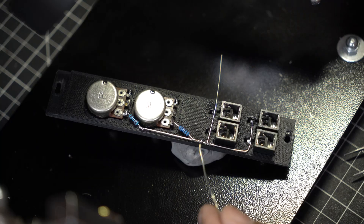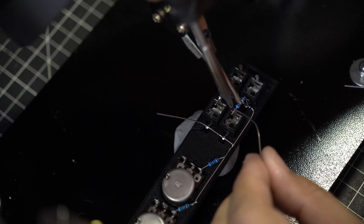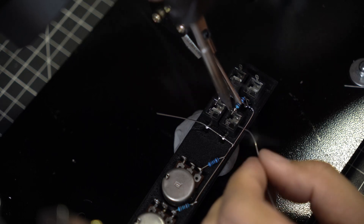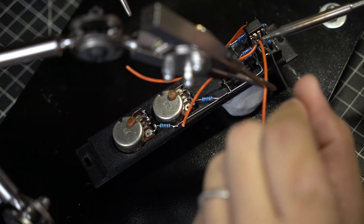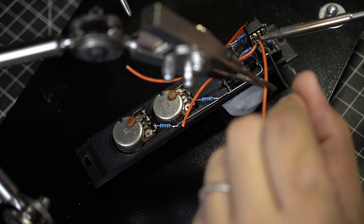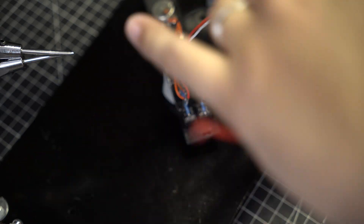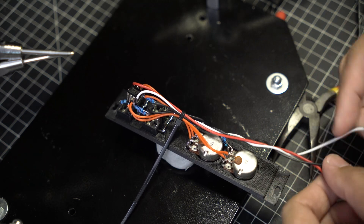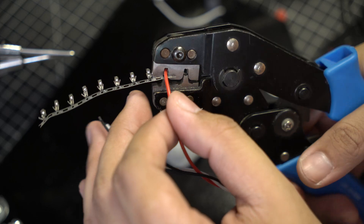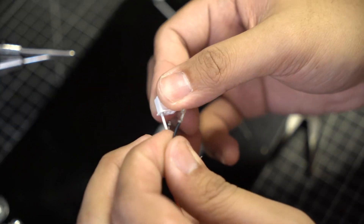After the ground connections, I start mounting the other components such as the ICs, the resistors, and the other passives. I don't really plan these builds, so it's like working with a puzzle, and you'll eventually get used to it. For power, I don't use standard Eurorack connectors because the sockets are a bit bulky, and it will kind of defeat the purpose of doing a dead bug build. So instead, I use wires and I crimp my own JST connectors.